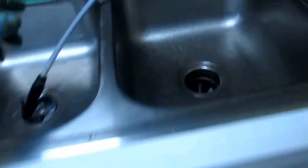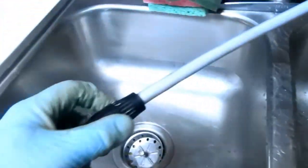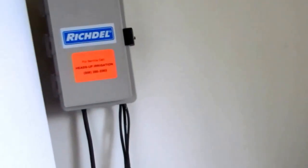I'll leave this open so if there's anything in there, it'll dry. I take the shower heads off — sometimes there's water in the line. I feel better with it. I'll leave everything open. This has all been winterized — traps, everything's done. Nothing can freeze. This has all been blown out with air, winterized inside. That line's all been dumped out. Irrigation system's all been blown out with air. Bathroom — make sure everything's open, been winterized.